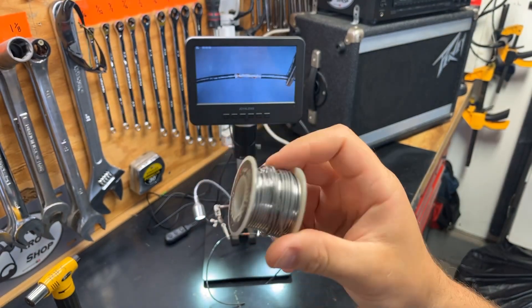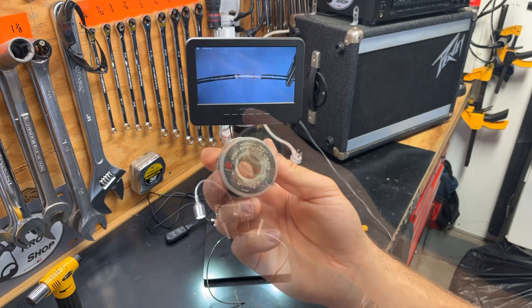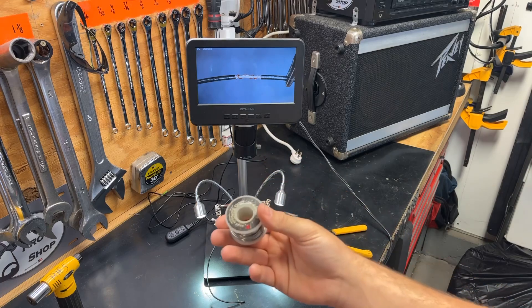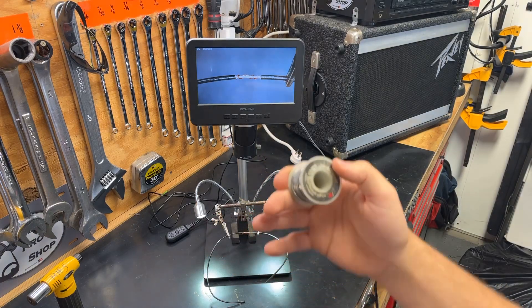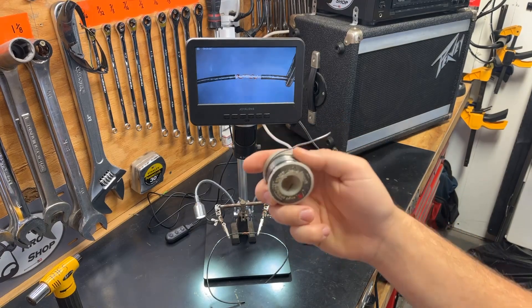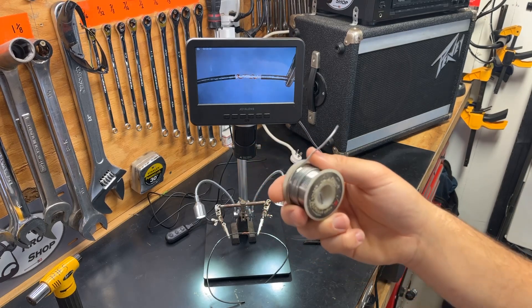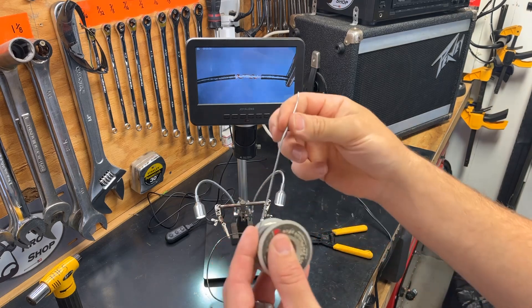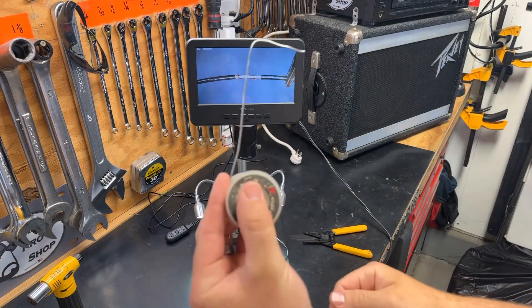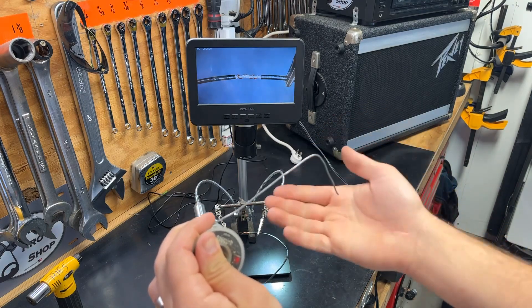I said Radio Shack — you can tell this thing has been around for a while. Man, do I miss that place. Can I get an amen? So, like I said in the beginning, this is super similar to sweating pipe. The way that this works is that you heat up the joint with the soldering iron — or in the case of pipe, the torch — and then the solder will follow the heat. This wants to flow to the hottest place in that joint. I treat this very similar to sweating pipe. Pull out a length and bend an end onto it. That way you can just hold the roll like this and get to where you need to go and still have a lot of room to see what you're doing.